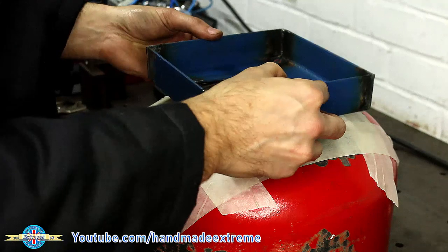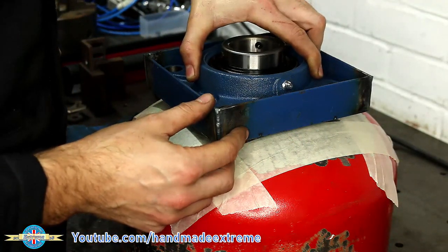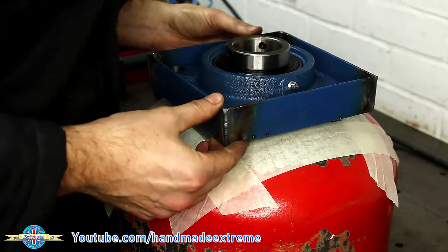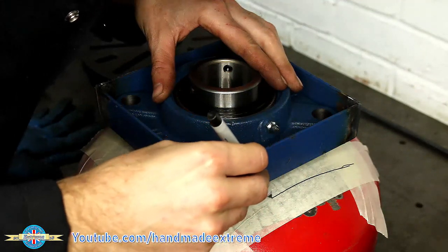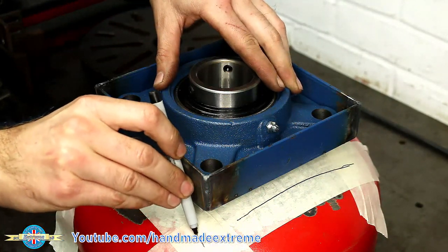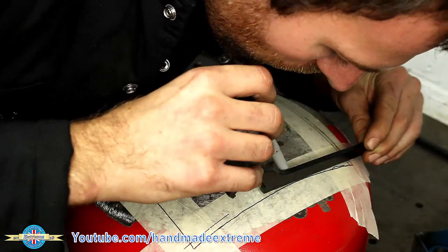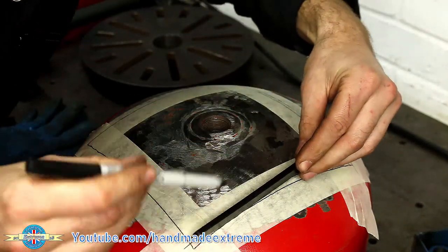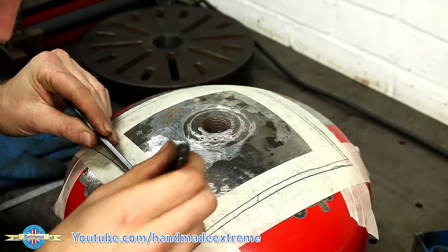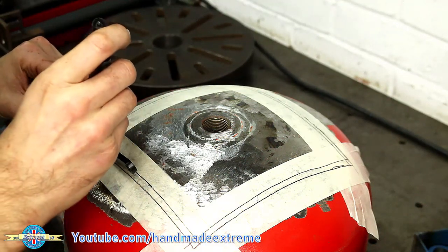Just a little check with the angle plate to make sure it is all square — looks good so far. Now to mark out the cutout it's a little bit tricky because of the shape of the bottle, so what I've done is just put everything on top, get it all lined up, put the bearing in because it's got a circular hole, and line that with the hole in the top of the bottle — that should get it pretty well in the center. Then I'm just using a fine point Sharpie, making sure to keep it completely parallel with the metal frame, to transcribe the edge line down onto the top of the tank, offset by half the diameter of the pen. I then inset that line by half the pen diameter to get the true projected line of the box. The C-spanner is just the right width, so there's nothing particularly special about it. Then we've got our lines that we can cut out for our box hole.